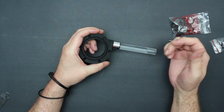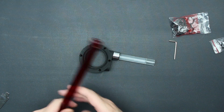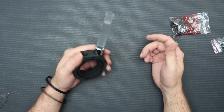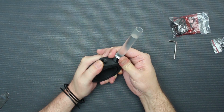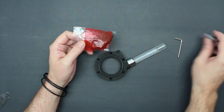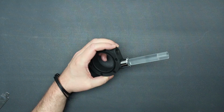This fit isn't as 100% guaranteed as our hard lock fittings, because those use the lock collars that are bonded on the end, which is a little bit extra work, and some people just don't want to mess with it. So this gives you almost as good pull-out resistance without the extra work of the compression with the lock collars. That about covers it. Just remember, don't mix the parts from the bags. Be careful to get the bottom O-ring actually in the groove and not sitting down on the flange.